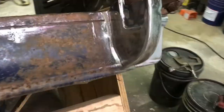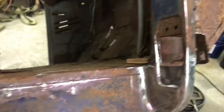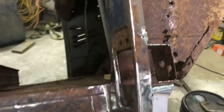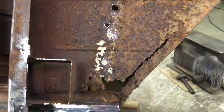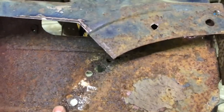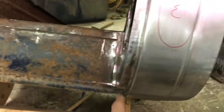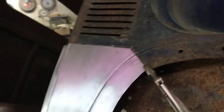Got everything cleaned up, all that bracing cut out, all those weld zones smoothed out. That's looking good. Now I've got to cut out the kick panel. It's going to force me to make some bead dies for my bead roller, which is good — it's about time. Just trying the skin on again, checking my measurement from here to the back. It's all good. Dinner time.